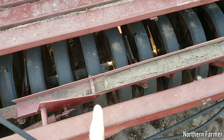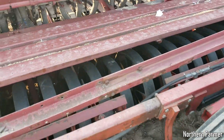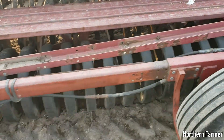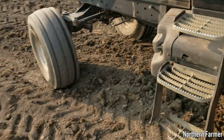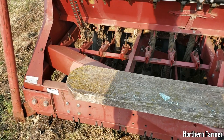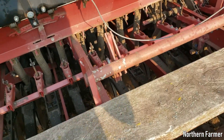There's a lot of time spent filling. The thing I really like about this drill — and I wish my drill had it — is the three-inch packers. I wish I had bigger press wheels on my air seeder because they're too skinny, not enough packing pressure. You can tell on some crops I planted that you don't get enough packing pressure when the crop comes up in the wheel trip tracks much better than it does in the open.